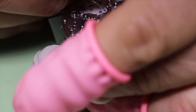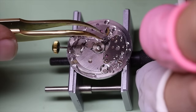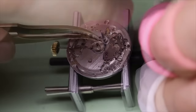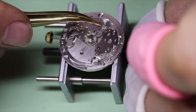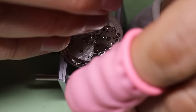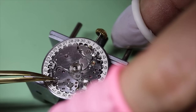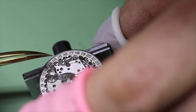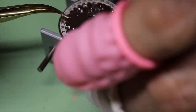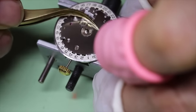Of course the pivots were oiled before we did the timing. Let's continue with the calendar works — put some HP 1300 or similar on the cannon pinion for the hour wheel, then intermediate setting wheels, and finally the calendar or date finger. The movement itself is in very good condition. There's no problem at all with this watch — no rust, just a little bit of dirt and some old dried oil. That of course is also a testament to the quality of the movement.